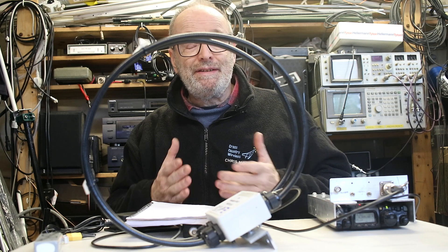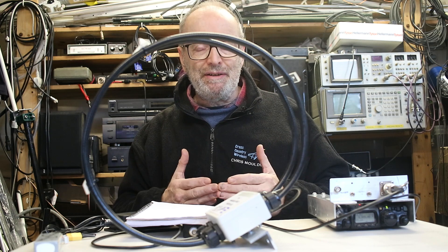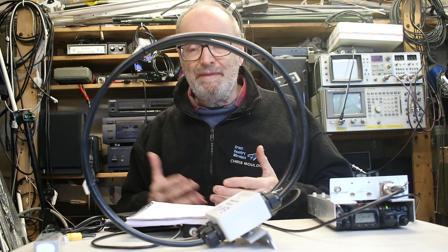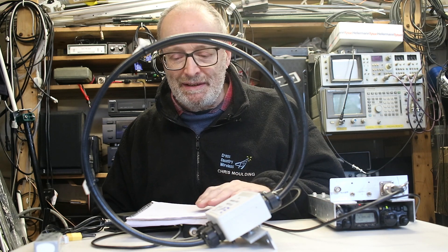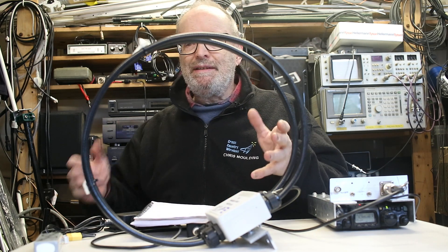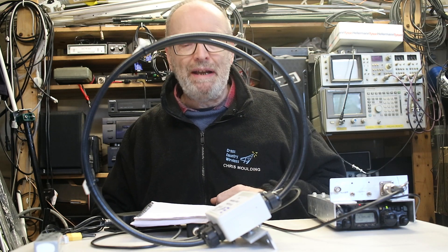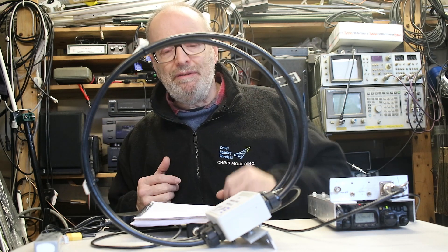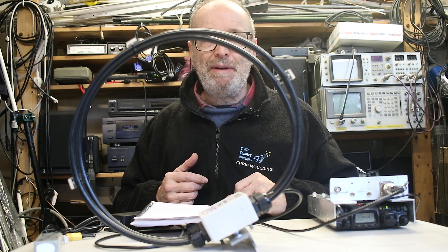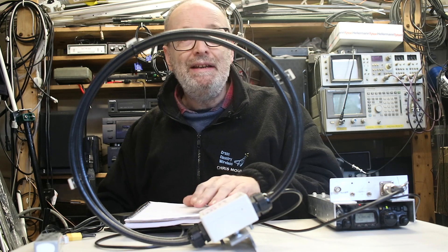The loop antenna amplifier is also wideband, so it will work from roughly 10 kHz up to 150 MHz — there's no RF filtering in it, unlike this one, so you accept the chance that VHF or VLF signals will affect it. This antenna is designed ready to go — it comes in a small box, just plug and play, and it's a small unit that can be used portable: throw it in the back of the car and go out in the countryside for very quiet RF performance.